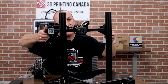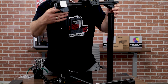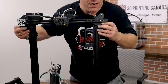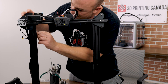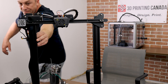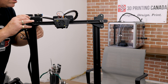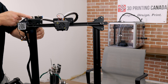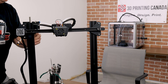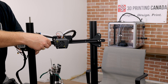So the next step — I'm going to get the X gantry and replace it onto our uprights. Now we want to be careful doing this not to bang up our Z rod at all. So line that up, line up your Z rod, get it started. And now we have the X gantry back on.